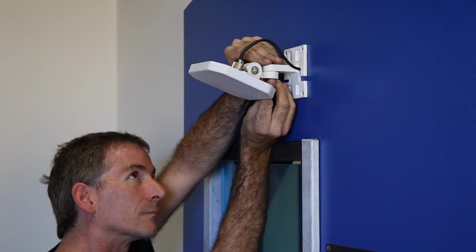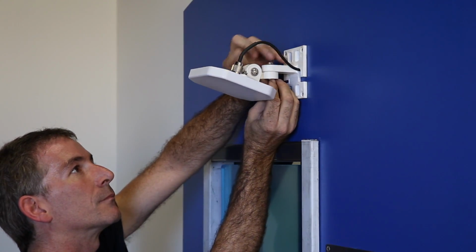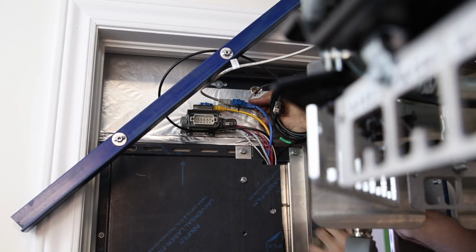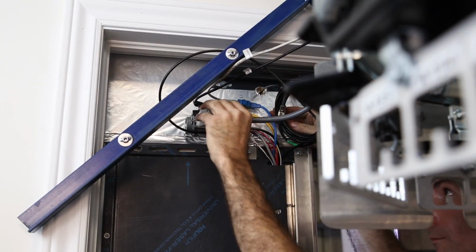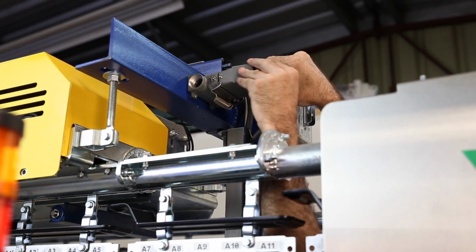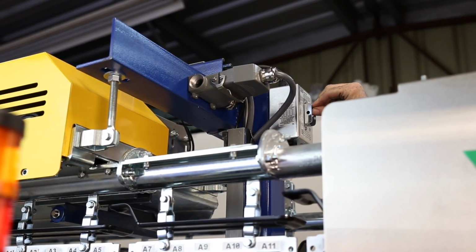Above the main kiosk panel, an RFID antenna is installed to track the garment removal from the system, and a lower tray is attached to ensure any accidentally dropped garments are easily accessible. And now the final connections are just as simple. We attach 2 Cat5 network connectors, the system access connector, and the RFID antenna. Then the main connector to the conveyor system, we power the system on, and the Packline automated uniform conveyor is now ready to test.